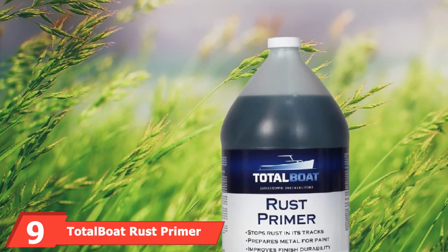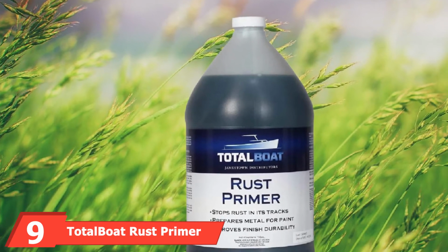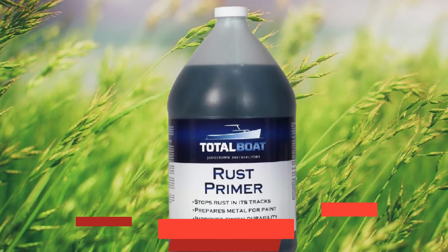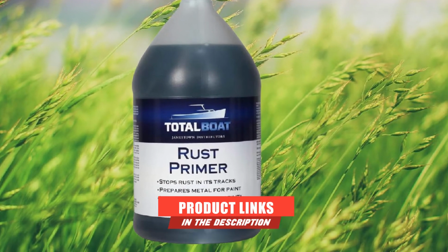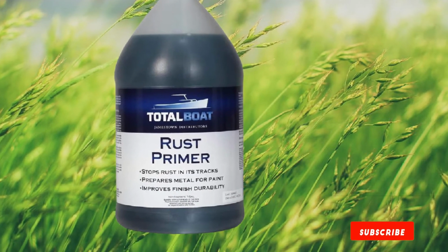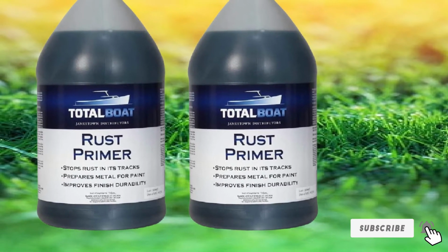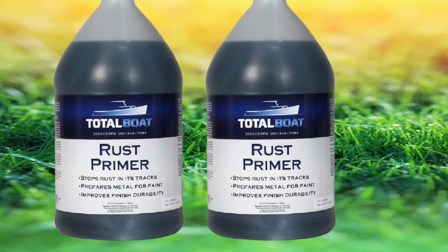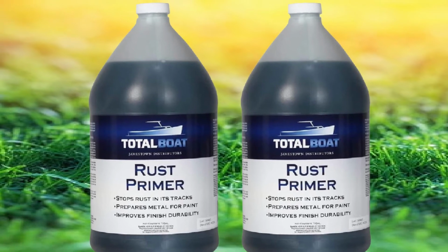Next at number 9 we have TotalBoat Rust Primer Converter. Instead of sandblasting or scraping, you can use the TotalBoat metal treatment to remove rust from the surface before painting it. It's a phosphoric acid rust converter that's formulated to remove rust by converting it into an inactive substance. It also acts as a primer and leaves the surface ready for the paint.